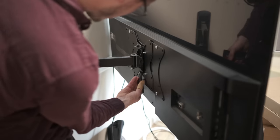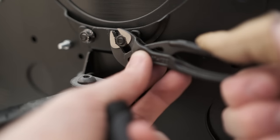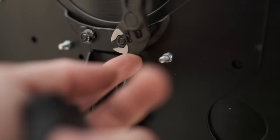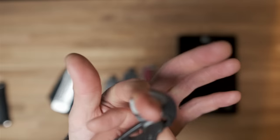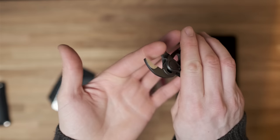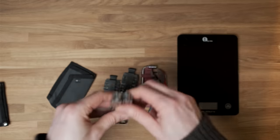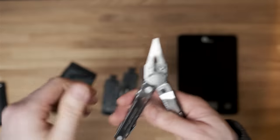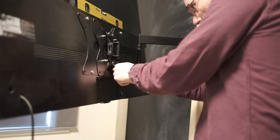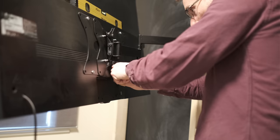The reason these Knipex are so good at undoing nuts is because of an angled latching effect. As you twist to turn the nut, it clamps tighter on the nut and just works really well. With the Leatherman pliers, as you rotate them the force of the nut pushes them apart — they don't lock on in the same way. These Knipex can grip nuts up to 24 millimeters, and once locked on you can keep pushing as hard as you like and they don't slip off.